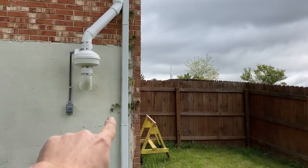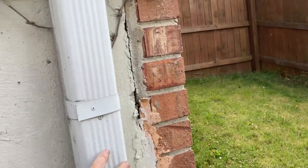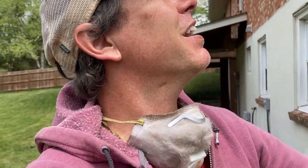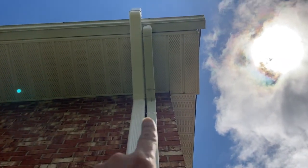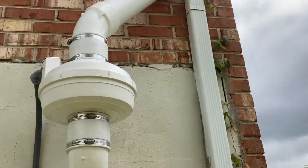The reason why using downspouts is frowned upon in my neck of the woods is the aluminum — the seams can kind of come apart at the back. As you can see there, it allows water to pass through but it's not airtight, and that's the problem. I get called in for work a lot of times just to simply apply a bead of silicone or something like that where the connection is made at the fan. So at any rate, we're doing it with PVC — everything's airtight.